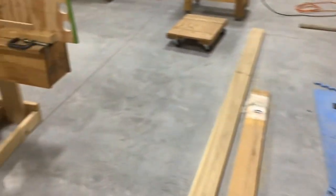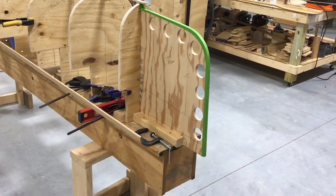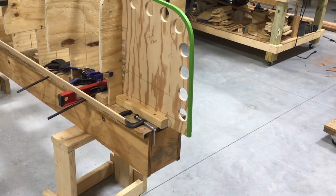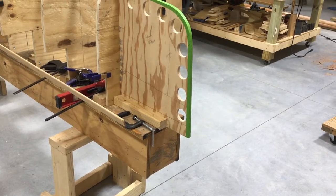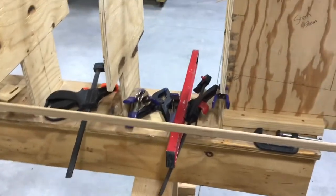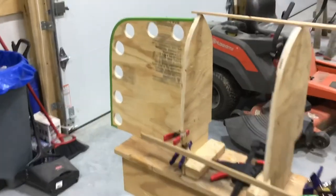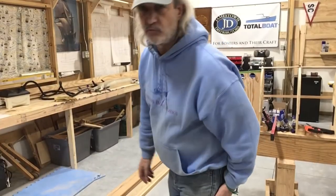While waiting, I got set up. I put tape on the ends of the stem molds so we don't have any glue or anything attaching the stems to the actual mold. Because once these are bent, we're going to glue them up and epoxy them together. I've got my clamps ready to go on both ends. They should be steamed now — we're going to try to get them out of the bag.